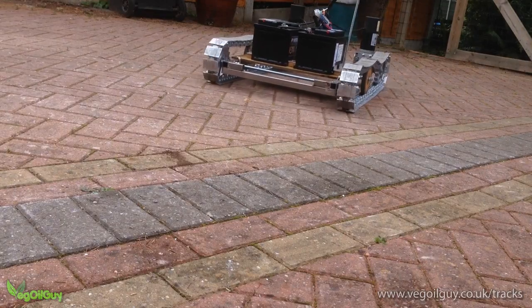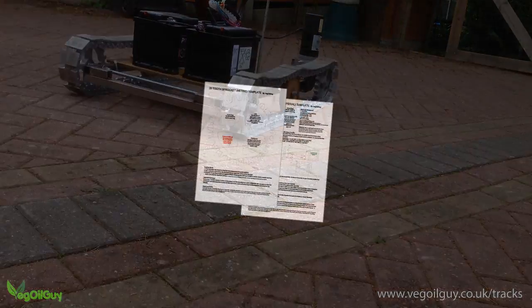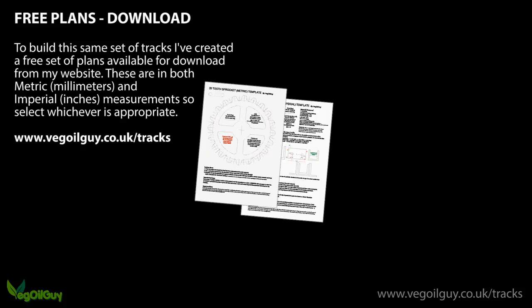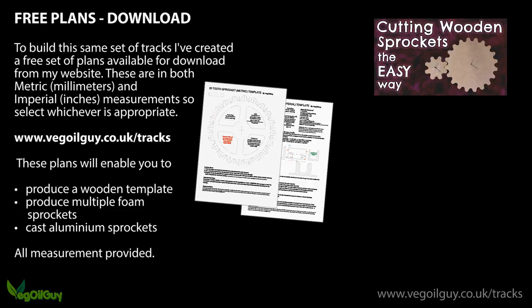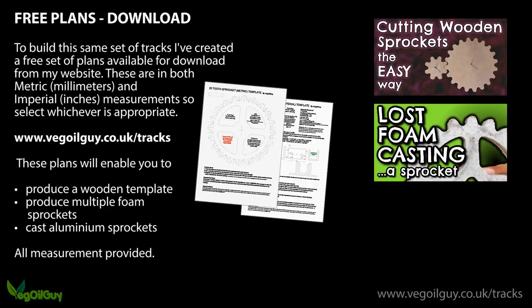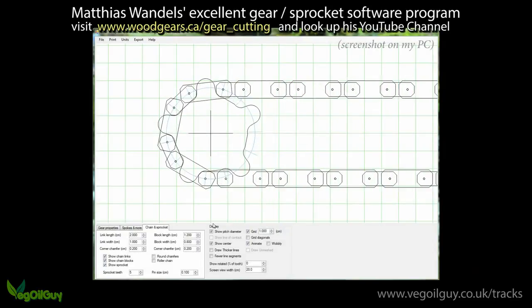Now, I'm not going to cover the making of a sprocket in this video, because I've already covered that before. But don't worry, if you want to build this exact same sprocket and track, you can download a free set of plans from my website here. This will enable you to make a wooden sprocket, i.e. a template, produce several foam sprockets using this template, then use lost foam casting to cast your own sprockets from scrap metal. I took ordinary soda cans and melted them down in my homemade metal foundry to make four of these sprockets.